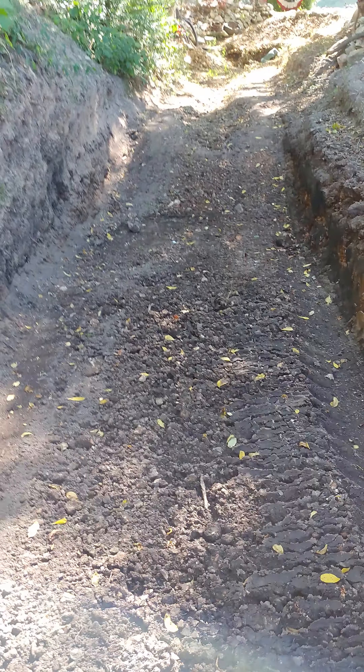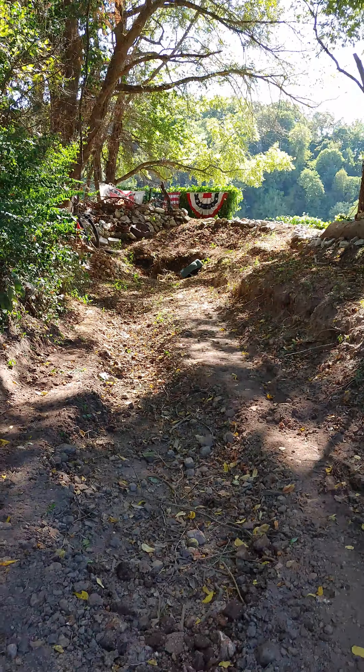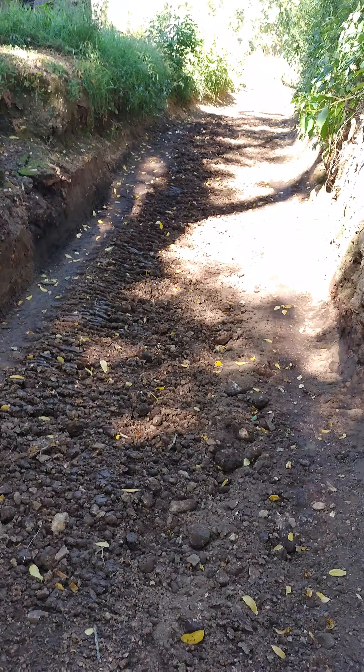This is where I was burning stuff, and it's almost six foot deep right here. This is where we run into that gravel layer. What I'm gonna do is break this gravel layer up — it goes from here all the way back there. I'll just break it up, back-blade it, and keep doing that. That'll eventually get that stuff pressed down into all this goopy crap. Get it good and packed down from driving across it. It's about time to start getting it to where it's gonna hold water.